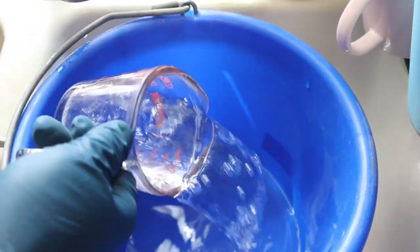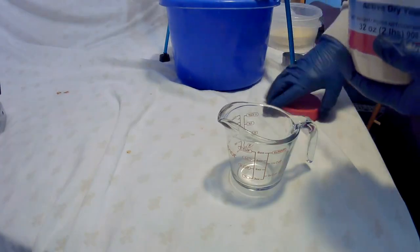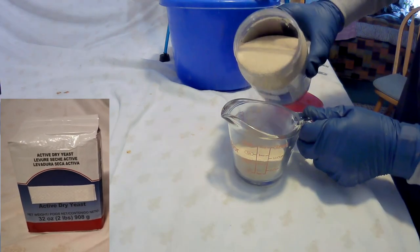All right, here's what we're gonna do for the shock treatment. You're gonna get yourself a bucket. I use a small 2-gallon bucket, but even a large pot would work. Get 3 cups of lukewarm water, 2 cups of sugar, 2 cups of cornmeal, and 1/2 cup of bread yeast. This is in the description. We buy the big bricks of yeast at Costco and use it for this and bread baking, and it's very inexpensive. Replacing and adding baker's yeast to your septic system is a healthy way to maintain and keep your healthy level of bacteria in your system, and it's the exact bacteria that you need. People don't know that, so it's the very bacteria that you need in your septic system.